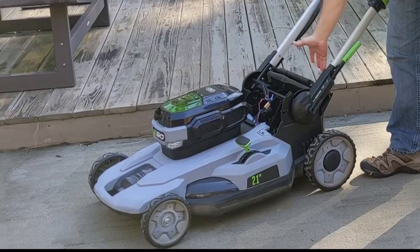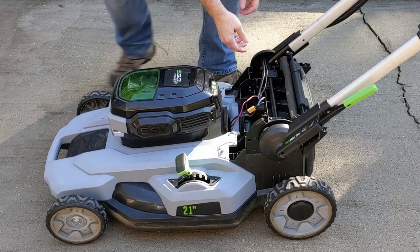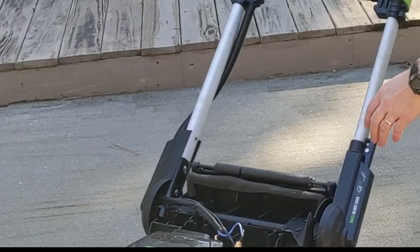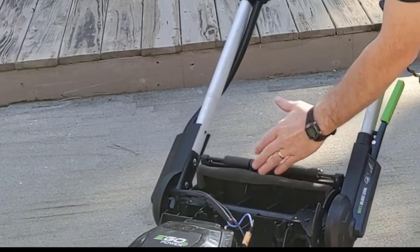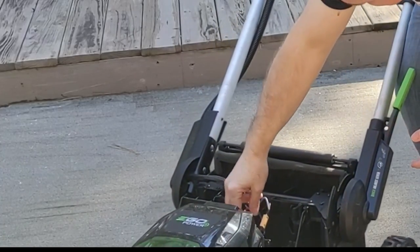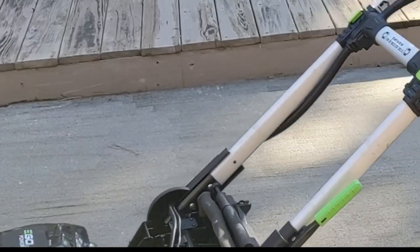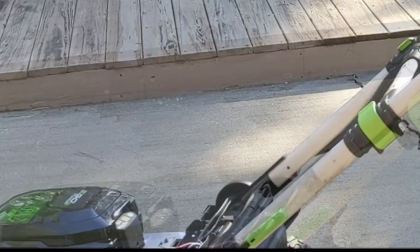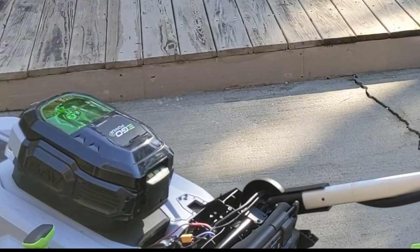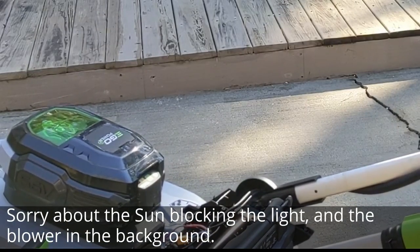You can probably see the two red wires together here — the guy had already jumped out the handle switch. Where the handle's in position, it was already jumped out and the two red wires are together with just a butt splice on them. When I tested it out, it had the classic symptom: it tries to come on but the yellow LED blinks, while the battery stays green.